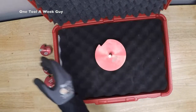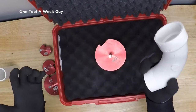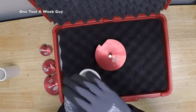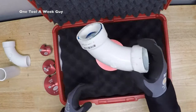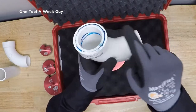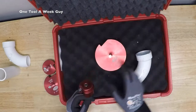Sometimes you run into a fitting — let me show you. Take for example this fitting right here: you go ahead and glue it, and then measurements change, walls change, certain criteria change, and now you don't have the fitting in the middle of the night. So you chop it off. I have a mock-up here — this is an inch and a half schedule 40 90-degree fitting, DWV, not meant for pressurized fittings. I cut it flush and you can see the glue around it, the pipe inside and the fitting on the outside.